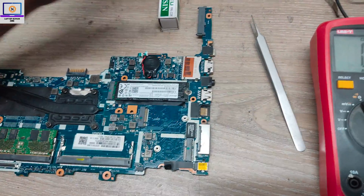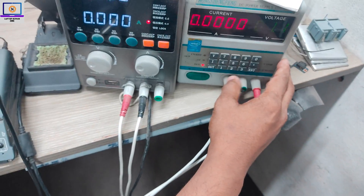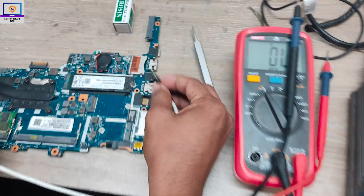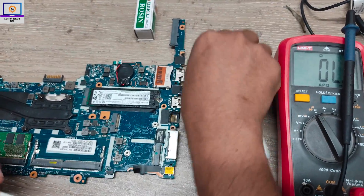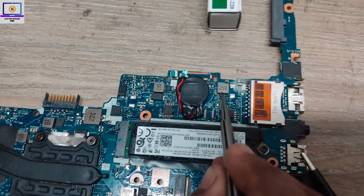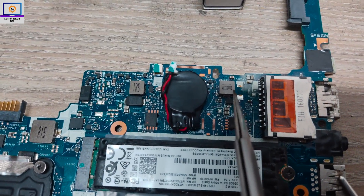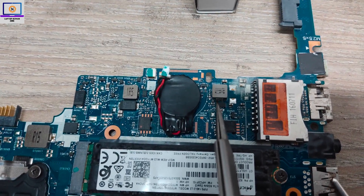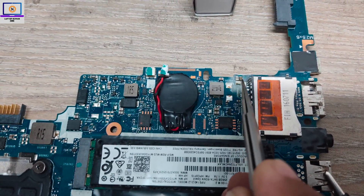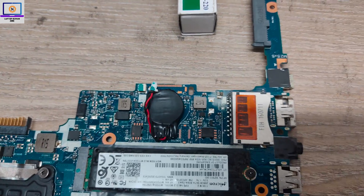I put a little bit of smoke here. Then I will set my power supply to 1.5-volt and connect ground. I inject the voltage into the 5-volt rail. As you can see, this capacitor is short to ground.